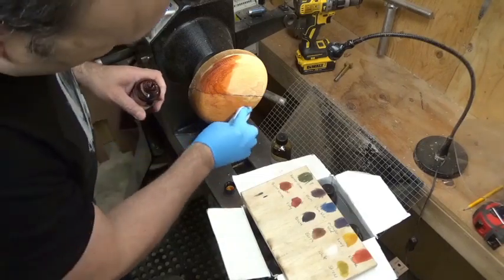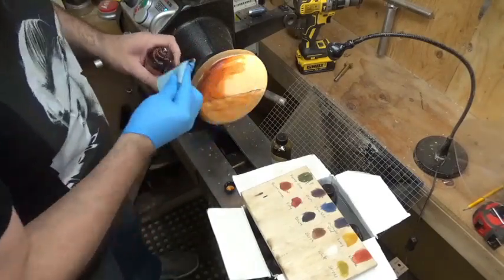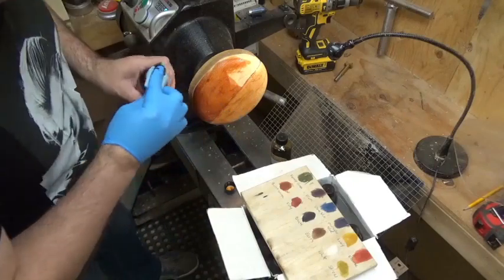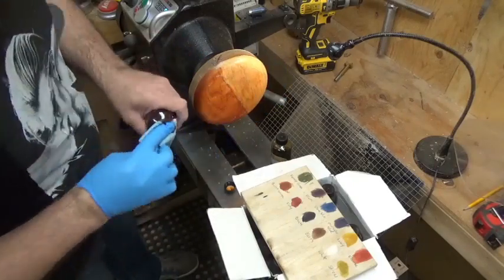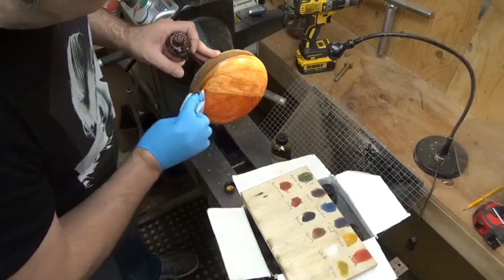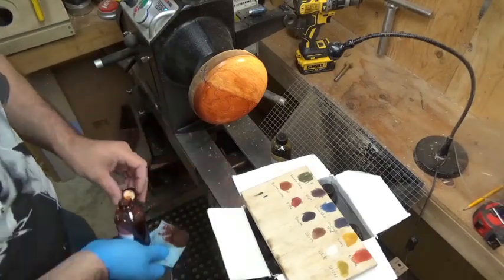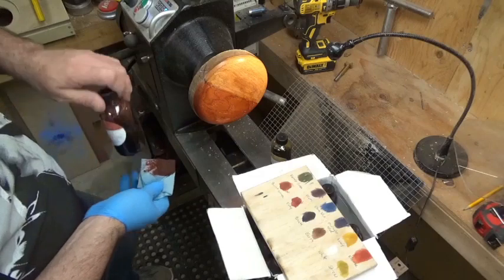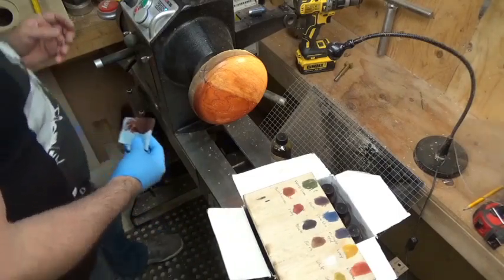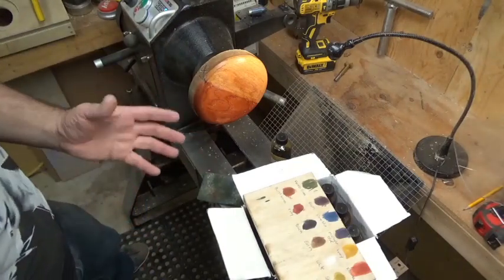It's not going on the sealed side like it should, or at least like you would expect it to — like it does on the unsealed side. We'll soon find out as we get through this. Then we'll go with our honey, or maybe denibb it a little bit with a scouring pad. I don't really want to sand it because then you'll be taking away the sanding sealer and it's not really going to give you a true result.